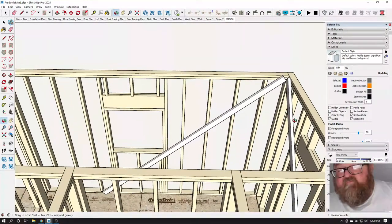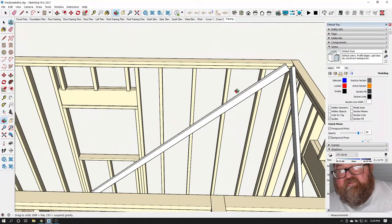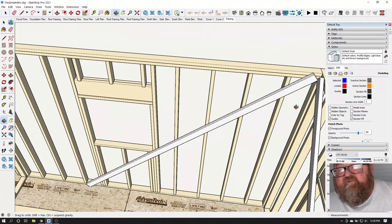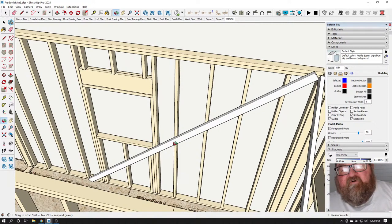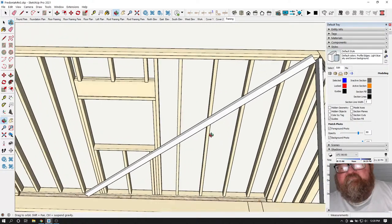Now you can literally push this corner back and forth. What we're going to do is hold it plumb, and when I get it perfectly plumb, I'm going to have my helper put a nail in the bottom plate and come up halfway and put one there too. You can actually use these braces to climb up on the walls, but I have seen people fall because they weren't nailed in the middle — so nail it at the bottom and in the middle.